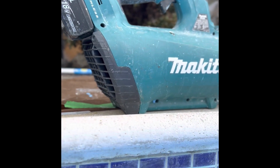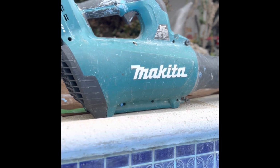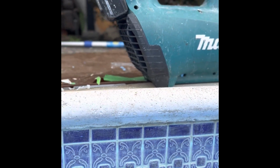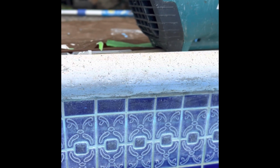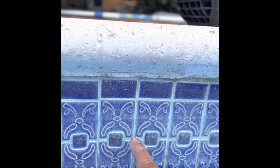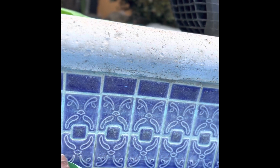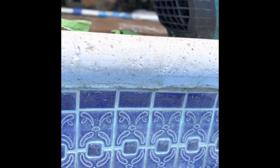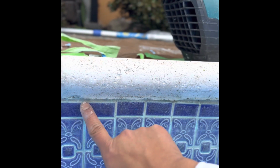So when you are actually working on the surface of the pool, what you can do is apply this type of tape, duct tape, masking tape, and cover basically all of the tile. Then whatever lines you want to paint on, like let's say you wanted epoxy blue here, you would have to basically have the whole thing taped to make it easy for you. Go back and then cut here, cut here, cut here, cut here. It's time consuming, but whatever grooves are in the tile, you would cut, and that would give you an opening to go ahead and lay the epoxy over it.